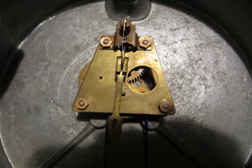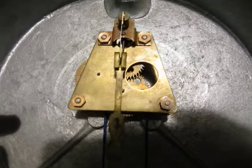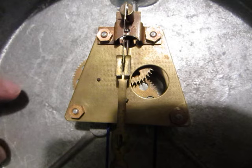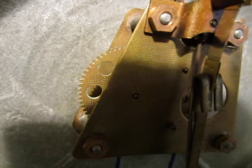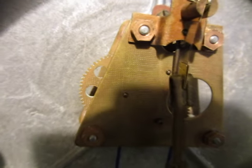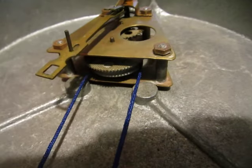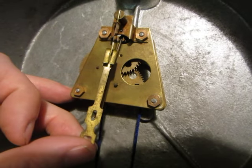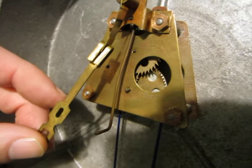It's just what I call a three-wheeler: a 24-hour weight-driven movement. It's been made from metal that's been dotted, which is not usually found in German clocks but is often found in Russian clocks. Also the wheels are dotted, and that is something I've never seen in German clocks but have seen in Russian clocks. So I'm wondering if this clock was made in Soviet Russia. The blue cord doesn't belong to the clock — I bought that cord. This pendulum leader is just one I found in a drawer, and the actual crutch is just a basic wire crutch.